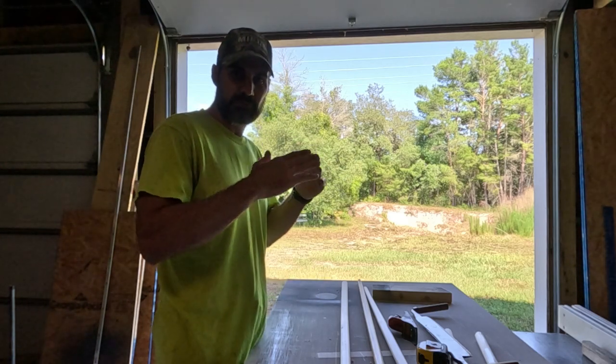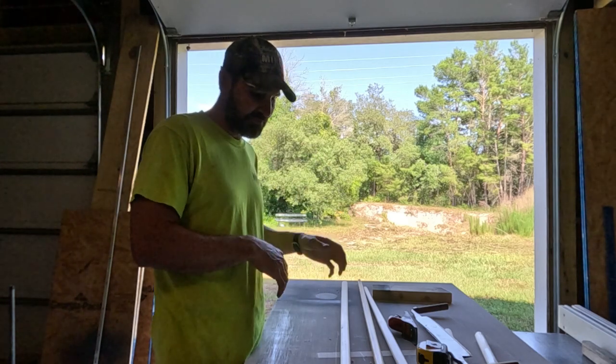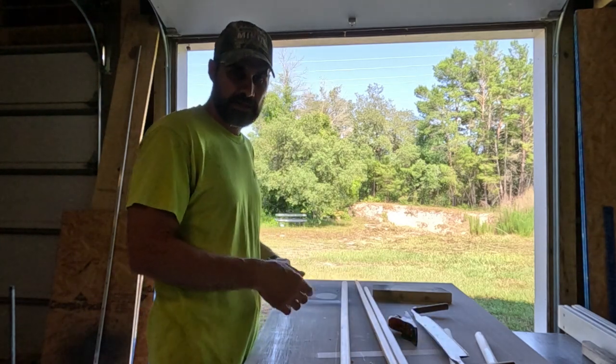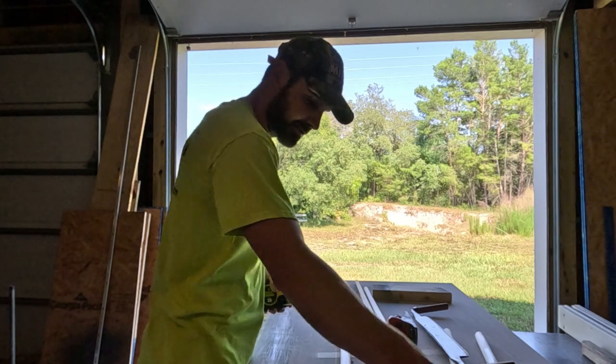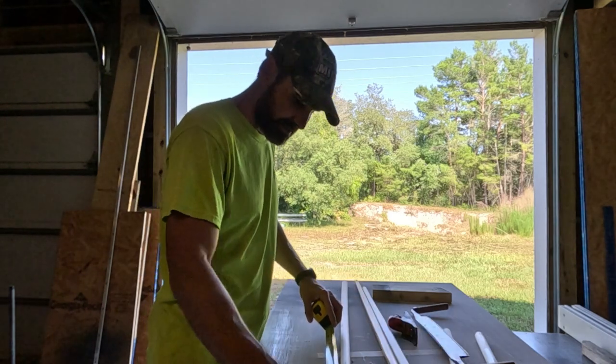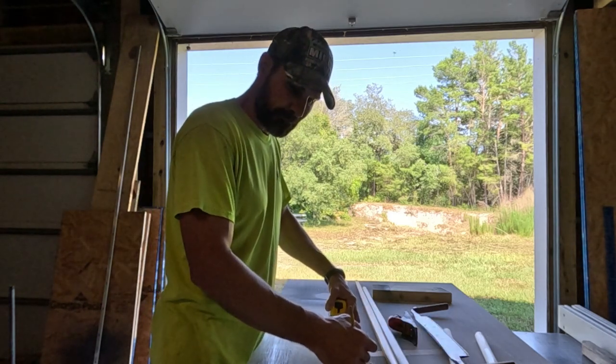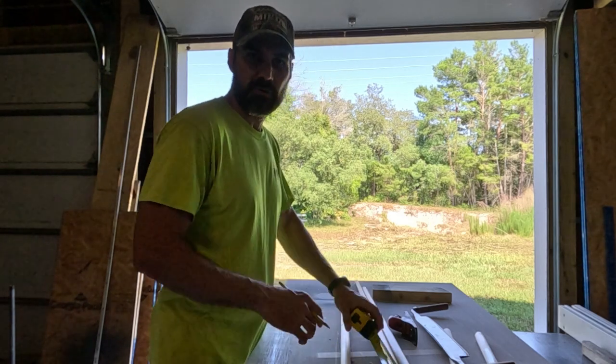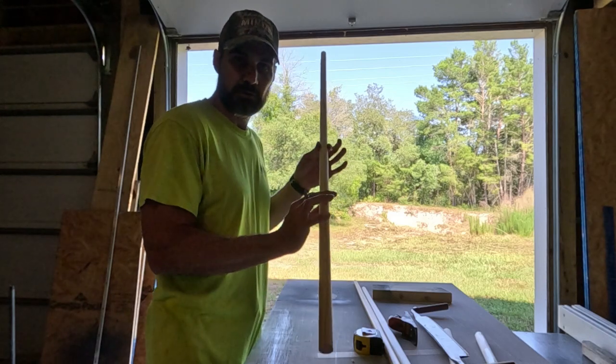And that's our fulcrum. That's where that taper begins. So I was able to figure out where that was. It's actually 16¾ inches back on our stock. So we go out to the end, measure back 16¾ inches, and make a mark on our dowel.